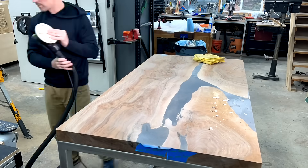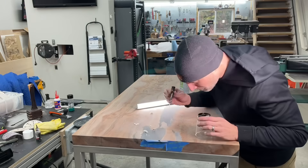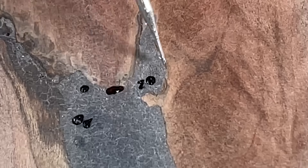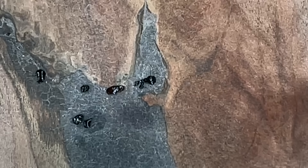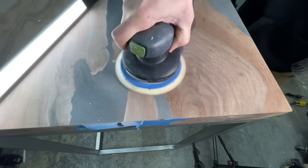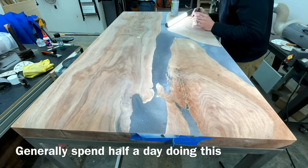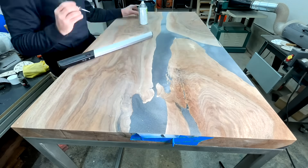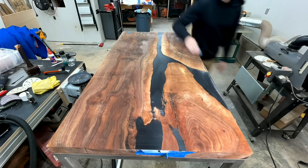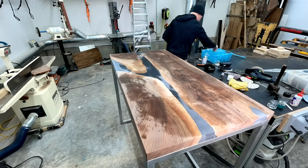Now that I had that fixed, I can continue with the finish process. I have that finish video linked in the description. What I'm using here is CA glue and an activator. When I first discovered this, it was like seeing sound in a movie for the first time — incredible. I'd always used epoxy for touch-ups before, so there was always a day between filling any tiny micro imperfections. Now I can fill these very small imperfections and have it cured and sanding in about 10 seconds. For very, very small imperfections, CA glue works very well.